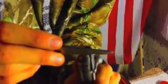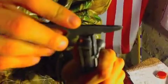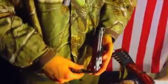Once you've confirmed the no-go gauge doesn't pass, go to the third one from the right — the 2.42 millimeter gauge — and that is your go gauge. It must go. If it doesn't, your headspace is too high and the firing pin may over-aggressively strike the primer, which could result in the bolt flying back toward your eye. We're good on headspace, so we're clear to lock it up.